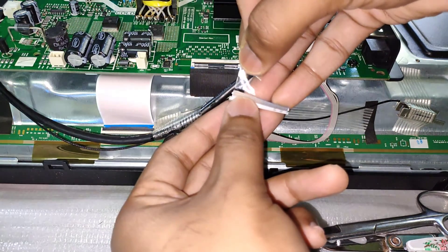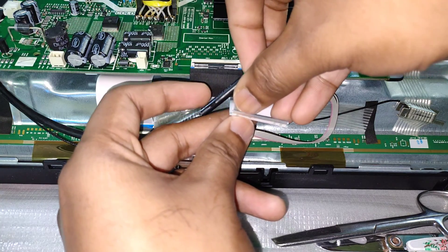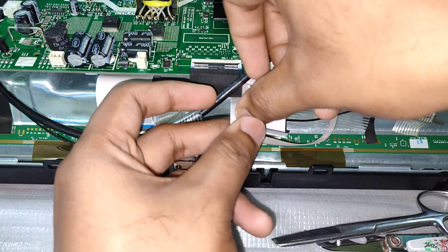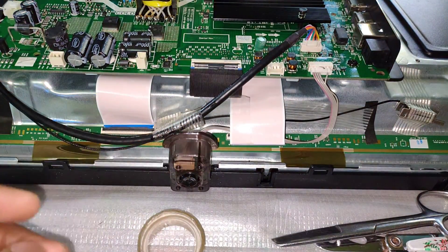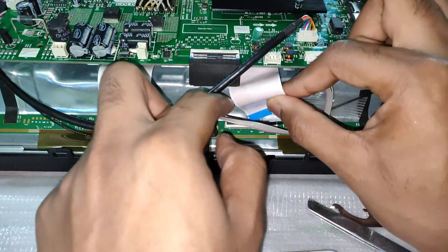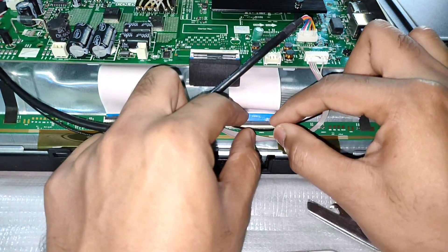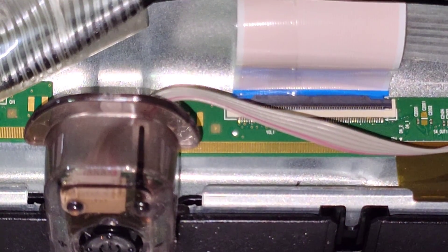Through this ribbon cable, horizontal and vertical pixel signals are being transmitted. I had to check which region gets isolated when I mask a particular area. You have to be very careful while handling these ribbon cables and the plastic latch mechanism — once they get damaged it's really difficult to fix them. Those solder joints are very thin and require really fine tips of a soldering iron to solder again, so you have to be very careful.